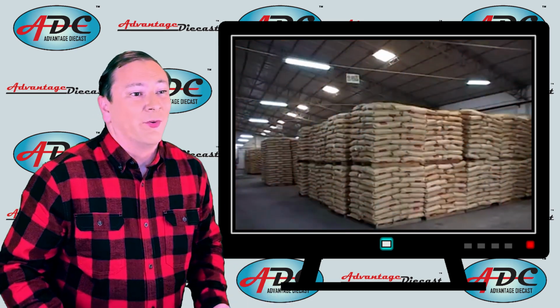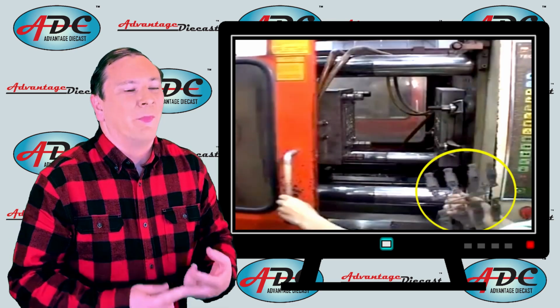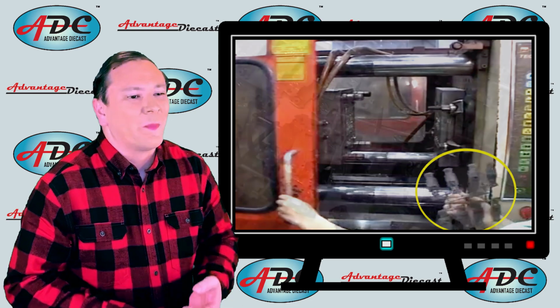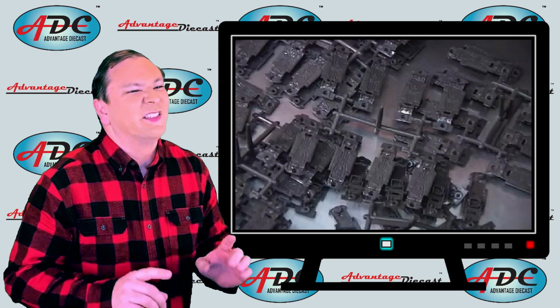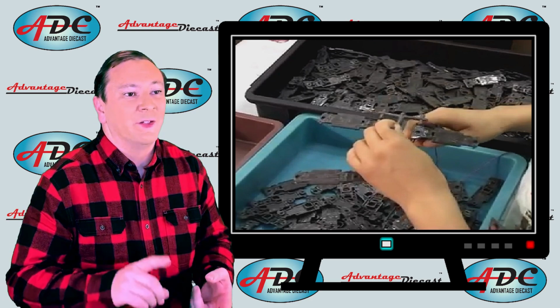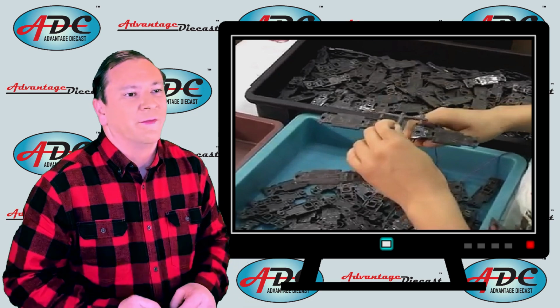Plastic parts start with the raw materials as well. The raw materials are injected into a mold in a high-pressure plastic injection machine. This makes our plastic parts. Here we see a chassis for a simple model car that's still attached to the sprue. These parts are then clipped off of the sprue and ready to be sent off to be painted, or to be chrome plated, or off to final assembly.